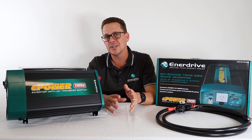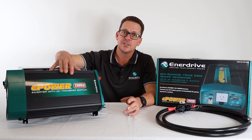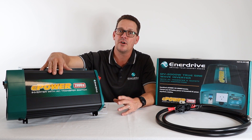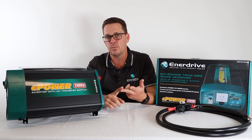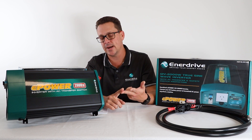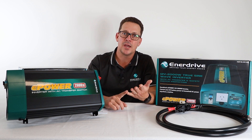Really, all those appliances that can't be run off DC — that's what an inverter is there for. It takes your DC battery power and converts it, normally via high-frequency transformers nowadays. A lot of older inverters are transformer-type, which are larger and heavier than the newer high-frequency technology, giving you 240 volts out. Many people nowadays don't like carrying the weight of a generator or worrying about petrol or diesel, so there's no need to carry a generator or jerry cans of fuel. Inverters are also great in applications with noise limits — more and more caravan parks prevent generators, and the same applies in marine applications.